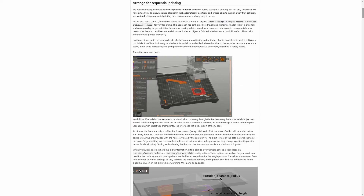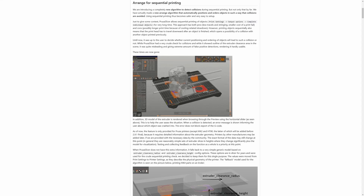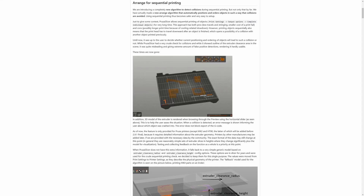Sequential printing prints each object separately and in sequence, ensuring that the print head does not collide with already printed objects. This is useful for multi-part prints as there are fewer travel moves, fewer Z hops, less stringing, and less chance of artifacts from one object's geometry affecting another in the same print job. It could also save a whole print from failing when one object fails, which is really useful if your printer doesn't have object deletion built in. This would also technically mean you can print in vase mode for multiple objects in the same job without fear of a collision.